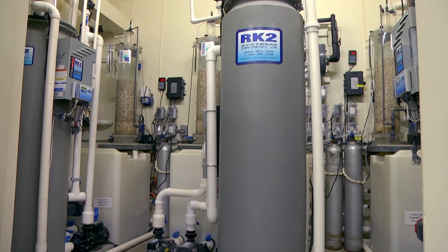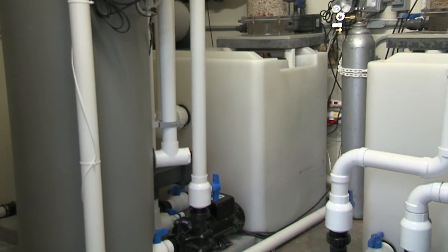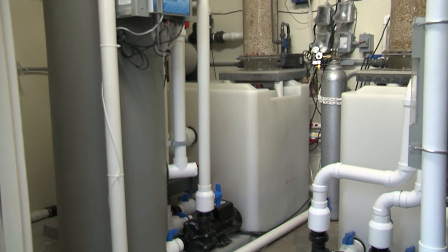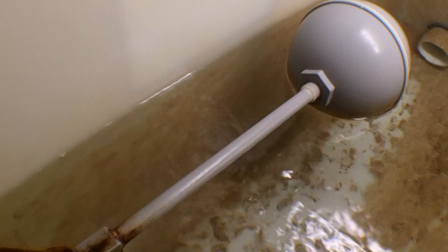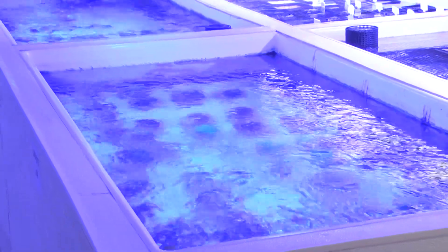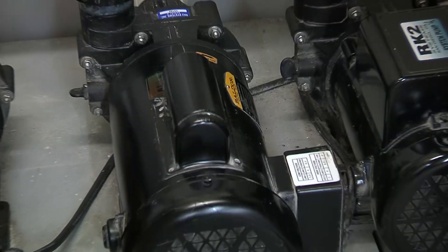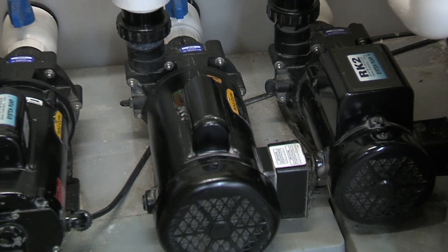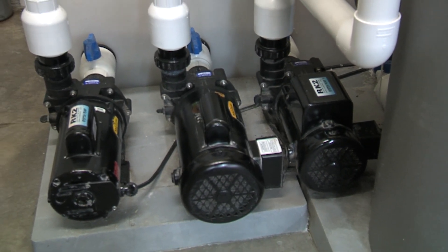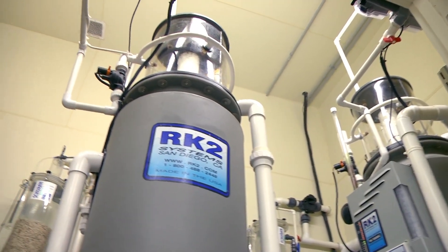The three main coral filter skids are located in the filter room. Large sumps serve as the main hub for the filtration system. They each have a float switch that will automatically top off each coral row with either RODI water or salt water depending on what is needed at the time. Three pumps are plumbed into the sump — a two horsepower and one horsepower pump push water back into the coral raceways, while the third pulls water out of the sumps and pushes it into the protein skimmer.